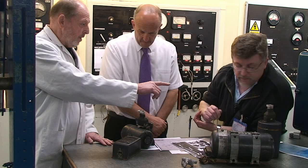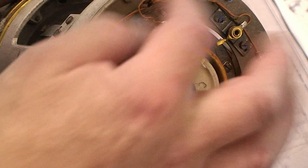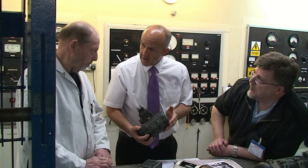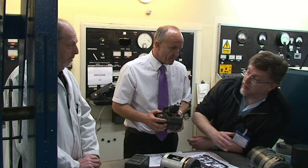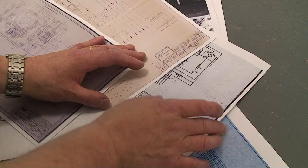We asked if it was just a single gyro — just the vertical component gyro, yes. Although it looks good, one of the problems with the gyro was always the fly legs, the pickups — you can see the pickups there, and over the years they've been touched by people. Martin said the inverter technology seemed familiar — very similar to older British types, like one from a Hurricane. The expert confirmed they could run it: 27 volts, about 10,500 RPM, straightforward. The frequency regulator was identified as a separate component, controllable via a screwdriver slot.